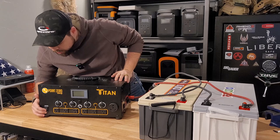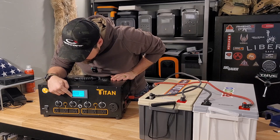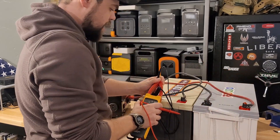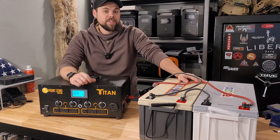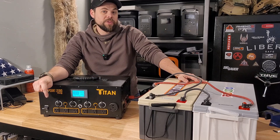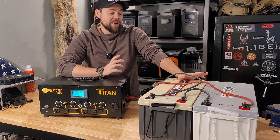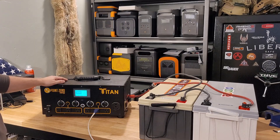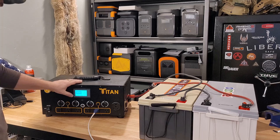It worked — but it's saying 28 volts on the screen, not 29. It is indeed 28 volts — you can see 28.1 volts on the Fluke. As soon as we disconnect these from the Titan batteries, the voltage dropped greatly. It's definitely not going to work optimally with the screen, simply because it's not going to hold 29 volts. I think that's why you have to have at least one Titan expansion battery — it sets the voltage parameter for the Titan to operate properly. It is cool that I got it to work though, and switching to AC output, it is working — but look how fast that voltage drops. So these batteries will not hold a higher voltage, and you definitely want at least one Titan expansion battery.